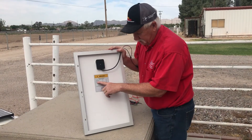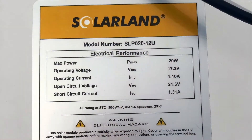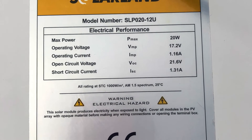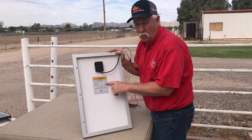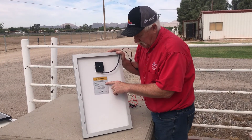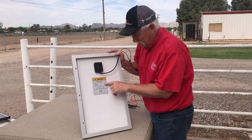One of the other pieces of information obtained from the cut sheet on the back of the solar module is operating voltage. This module, rated at 20 watts, is rated to produce 17.2 volts. This particular module works well with a 12-volt battery system — it'll have enough power to move volts from the module into a 12-volt battery.